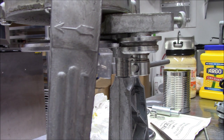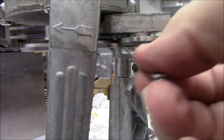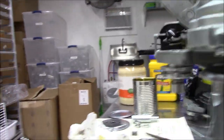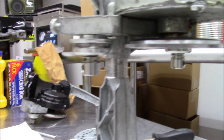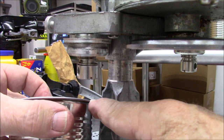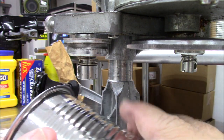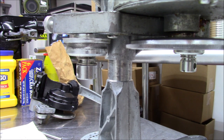That's number one, or the first stage — it's been snugged up. What the number one side does is it actually rolls the lip around the can. There's a little gasket right on the inside and you're going to want to roll it over. Once it rolls it over real good, side number two will actually push it flat and makes you a good seal.